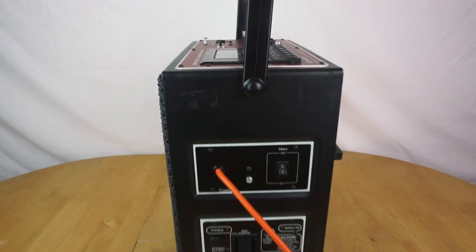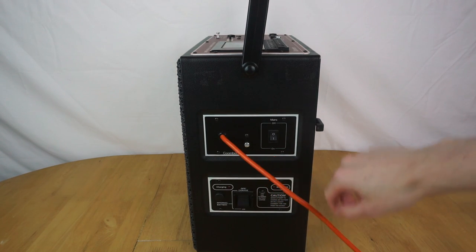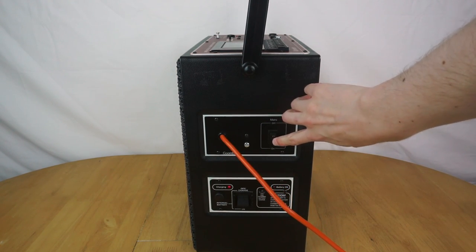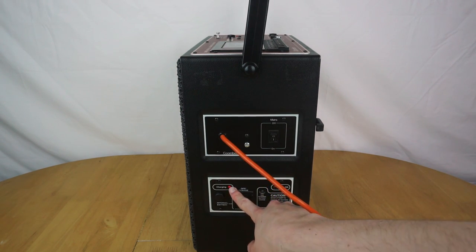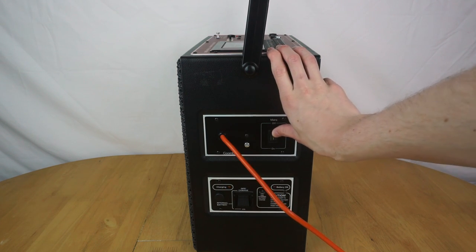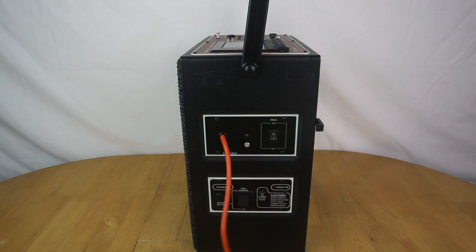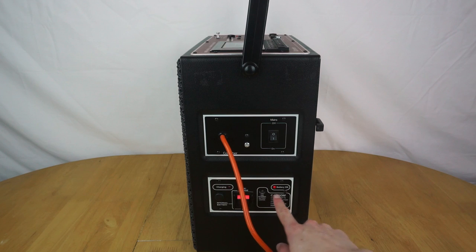batteries installed and they're now working. So you see down here, we have the battery charging circuit. If we switch the machine on, you can see the charging light comes on, and that now says it's charging, so that didn't happen before, so the charging is at least working. And if we switch the mains off, you can see the charging light goes off, and now if we turn it on to battery power, it turns on, and the battery light comes on to say battery okay.